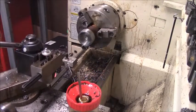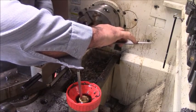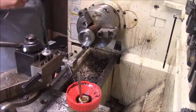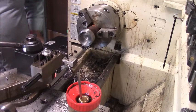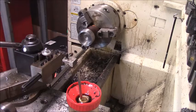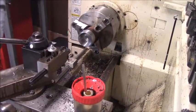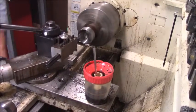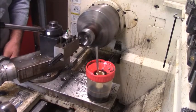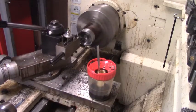So, let's check the size. We're looking for a little over 2 inches, 100 thousandths. So we are pretty darn close. Let me check for sure, but we're probably a little shade under 2 inches right there, about 1 inch 950, so hang loose. Okay, so I'm within about 80 thousandths right now. And if I'm off a little, this is not a world-ending thing here.